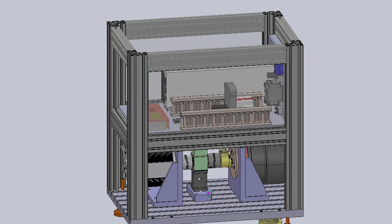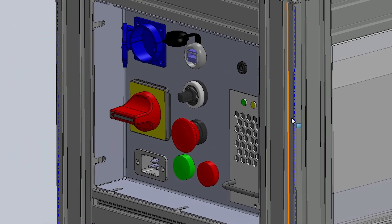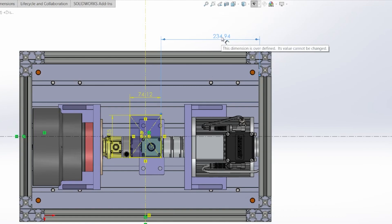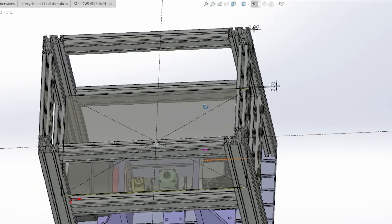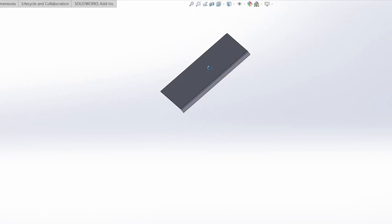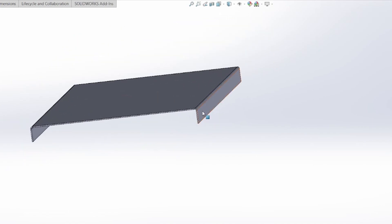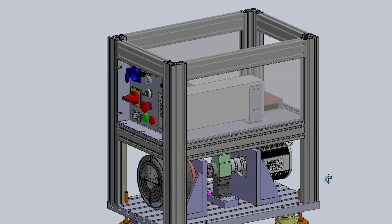Regarding the bender panels, they are widely used when it is important to customize mounting holes for electronics, including DIN rails, cable trenches, lights, switches, connection terminals, power supplies, and other elements for the control panel to properly control the device during operation. Another important feature of using these independent steel panels is that they increase the overall stiffness of the construction. More about the electronics system logic and electrical components will be covered in the next video.